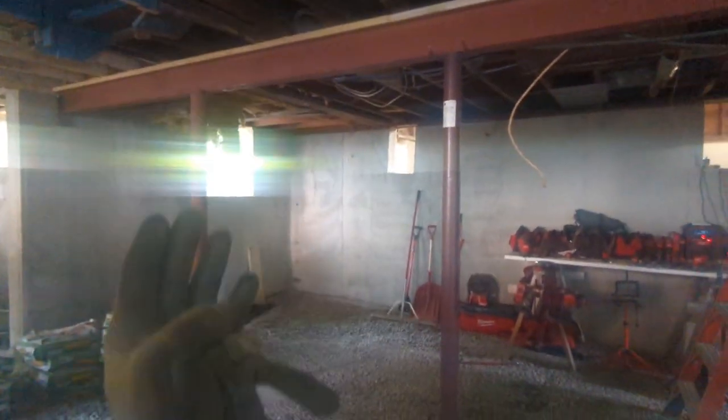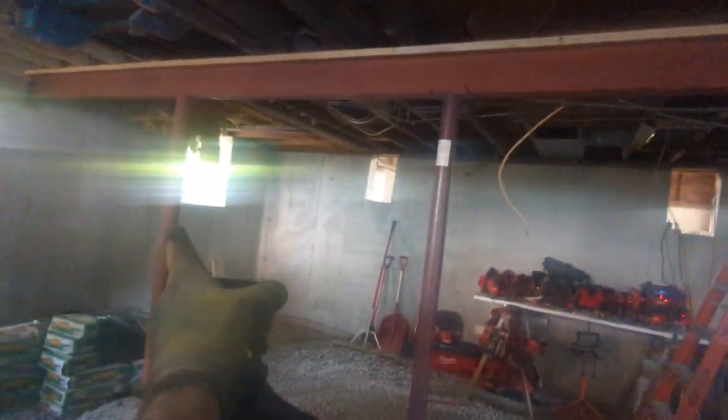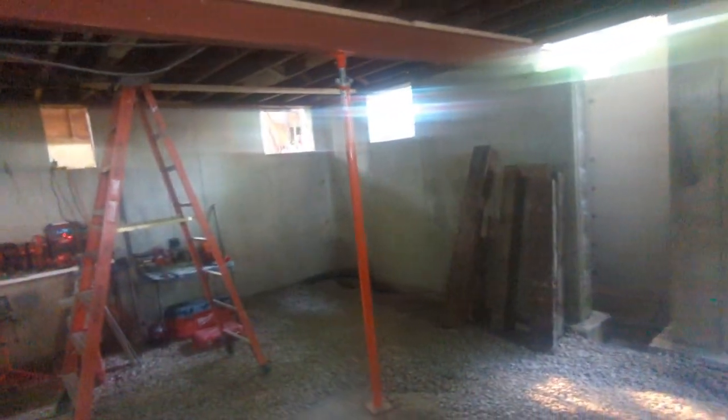which it could definitely be there and over there too, because that's about what's in there. But if I got something taller by 3 inches and potentially heavier, I want to check with the architect and see if I could skip. I mean, that's the heavy post because this is the outside wall, so it's probably not. I'm married to these piers, but wouldn't it be cool if I could move the heavy guy right here to the center of this pier and come up with such a thicker and taller I-beam that we would use the whole pocket in the concrete and we could skip the frequency of these posts.